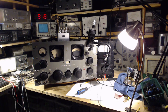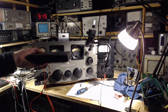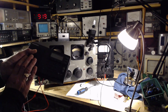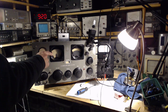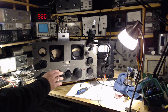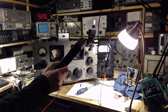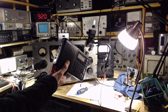Well, the first part won't be weird. I just got a small radio, and you can hear the hiss coming from it. I just have it tuned to 11 megahertz, and I was curious about the hiss coming out of a little transistor radio versus the hiss coming out of this radio. Of course, there's no hiss coming out of this radio worth even talking about. This is so quiet. I think it's 130 dB down the noise level. So I know simple transistor radios have problems with noise. So the question is, is this noise coming from the antenna, or is this the radio itself?